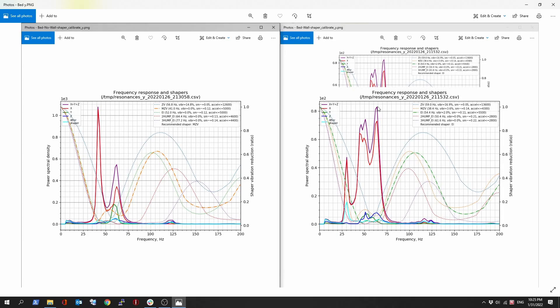Something more interesting would be to place the sensor on the actual frame and see what that does as well — I didn't do that test. But here are my results. I'm nowhere near a specialist. Quality-wise it went better — there's less artifact. If you try to go ultra-crazy without wall anchors, I'm telling you, you're going to notice crappy quality. It's going to ring. You can test that yourself and comment down below what your results are — I would be very interested in knowing what you get if you wall anchor the printer. On my side, definite improvement.